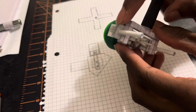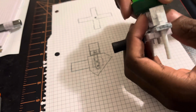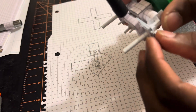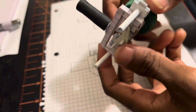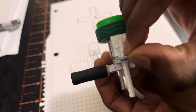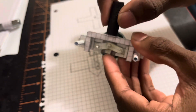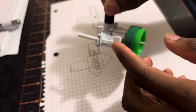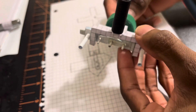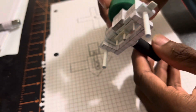It has to be the valve — you see how it got so much space right here? I tightened it up a little bit but it still don't run the best. There's a lot of air leaking out of there, you can see that gap right there. Too much air is leaking and it's not getting to the actual cylinder to push the piston down. The friction isn't the problem — it's really just the air leaking. That's what I figured out.